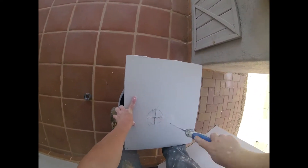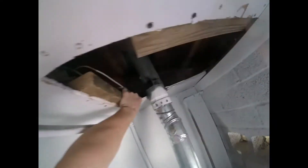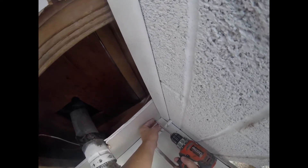We always tape around our pipes — so no matter what, even if we're off, we always tape up our pipes and make a nice clean finish. Even the best drywallers aren't going to be exactly right on the money. Simple trick here — without removing this pipe, work it in there. I like to get as many screws in here as possible. Cut this back where it's rigid, get the patch to sit just right. You always want enough screws so your patch won't re-crack out — that's the worst thing we can do. Where the new piece meets the cut, I put a one-by-two. These are the secret weapons of the drywall repairman.